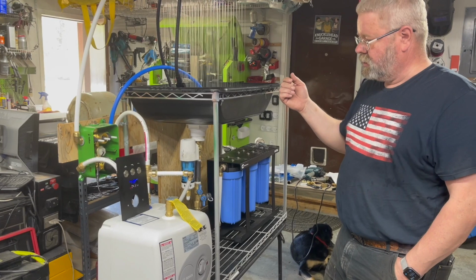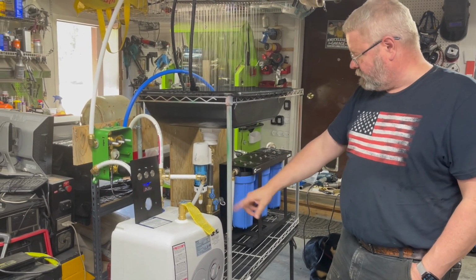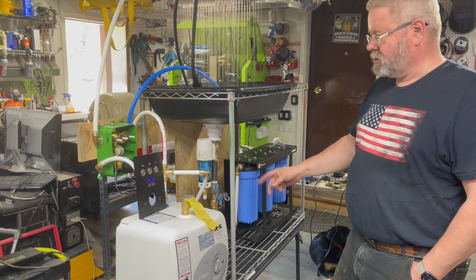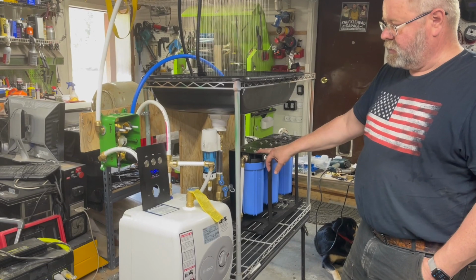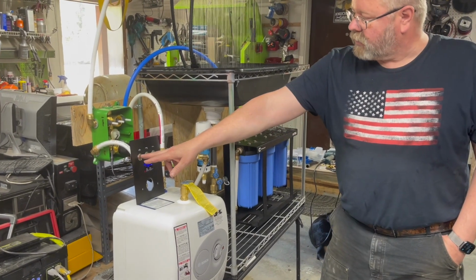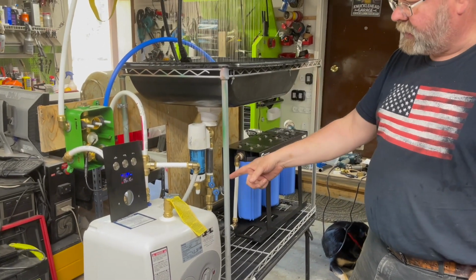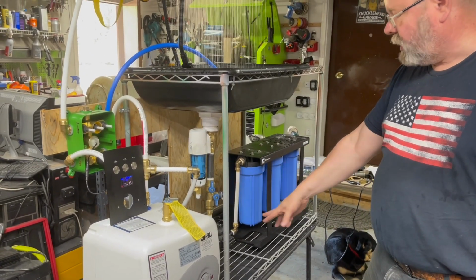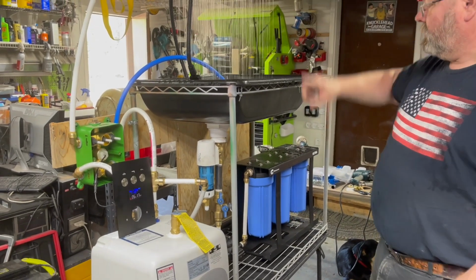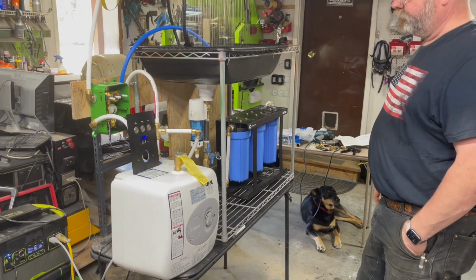So when the bathroom light gets on, it's going to energize the circuit that the UV and the pump are put on. Pump will probably just go over a couple times just to get pressure back into the system, and then just wait. If you're going to take a shower, you turn the shower on by pushing the button option you want. Water starts flowing, UV light gets turned on by the relay, pump turns on because the pressure is lost through the system, but otherwise it's a completely circular controlled system.